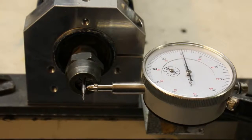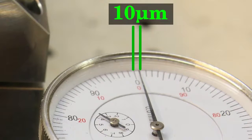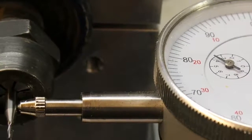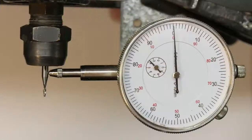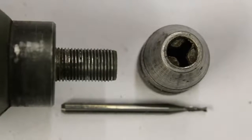The runout is an important factor for the quality of a machine. My measurement setup uses a dial indicator where one scale division equals 10 micrometers of linear movement. The tip of the indicator touches the 3.175mm shaft of a 1.5mm milling cutter — 3.175mm being one eighth of an inch. The tip of the dial indicator is placed as close as possible to the collet.